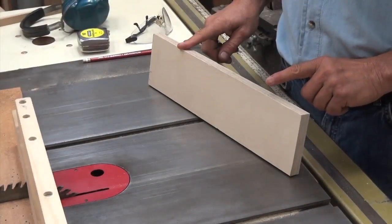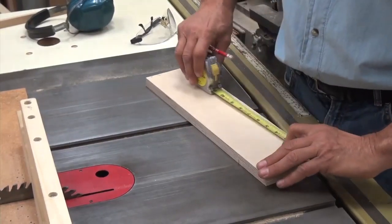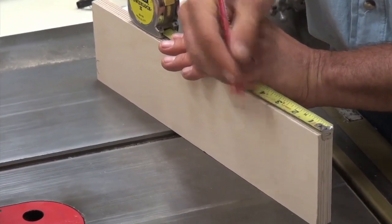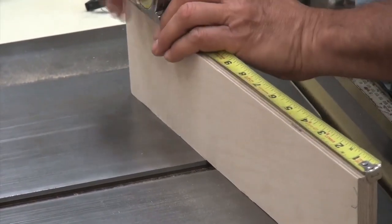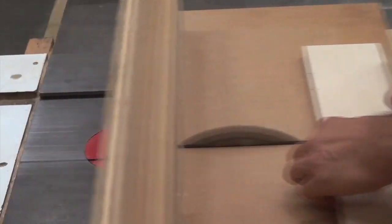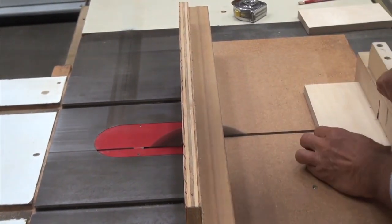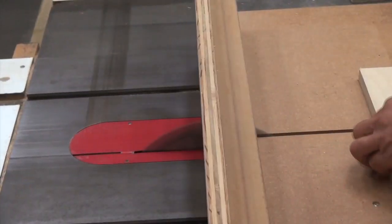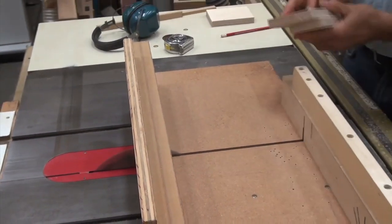This is the material that I would like to use for my joint spacer block and also my cutting block. And the cutting block itself is going to be 3 inches, and also my joint spacer block, which is 7 3/4 inch. Now comes time to cut. So, these blocks are now done, and now I can cut the solid wood cherry to the proper length.